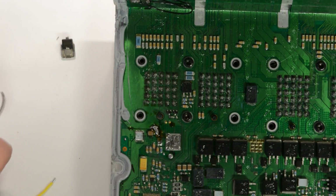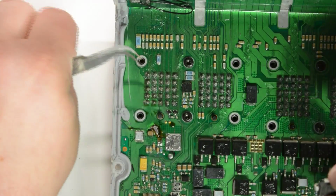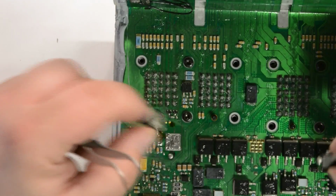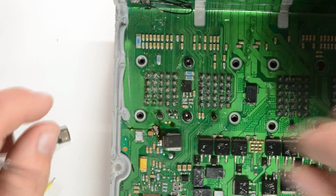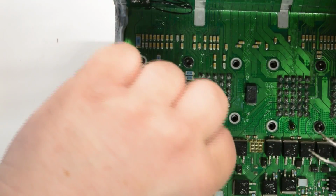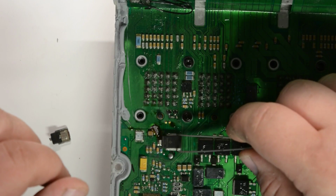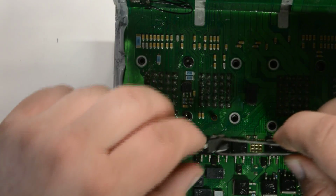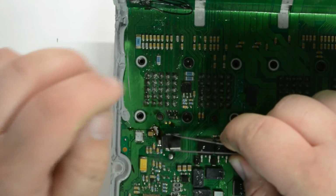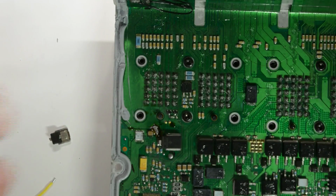And that's repaired. Like I said, you can replace the diode. Order the same one. They're easy to find online. It'll have a 27C on it, which is a 27 volt Zener diode. But like I said, if you're in a bind, need your vehicle running, remove this. If you don't have a soldering iron to remove it, what you can actually do on here is take a pair of side cuts and cut this leg off the end right here. You take and just snip that end to where it doesn't have contact through the diode itself. That'll get you running and back on the road.